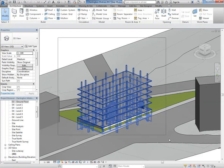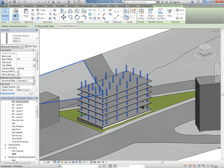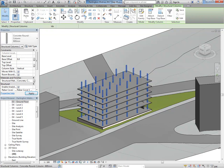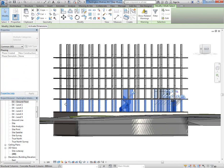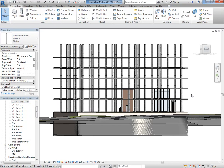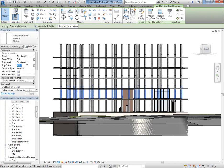The columns here, using Filter, can all be set up properly. The base offset looks right but the top offset is different — if it's blank that means it's got different values. I can just change that to zero. With Revit sometimes you just have to do it one level at a time. Ground floor should have been right, but I'm just checking — on Level One you can see the columns go too far.